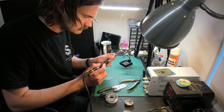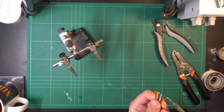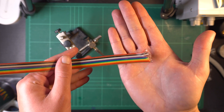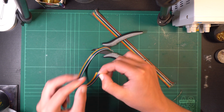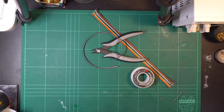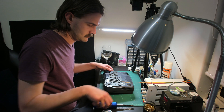We need 12 wires in total for the chip's input. This is a bit of a laborious task, but I started by stripping each individual wire and then pre-tinning them. After a bit of work I had both ends trimmed and tinned. Those 12 wires are for the chip's input, while we need to do the same thing with six wires for the output. For this installation we're following the official instructions on E-Tim's website — you can find that linked below. Now that we're done with the wiring for now, let's start by disassembling the N64.